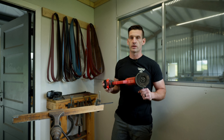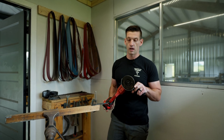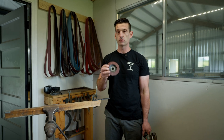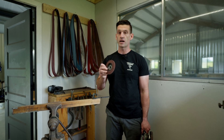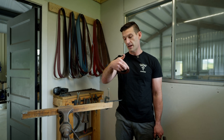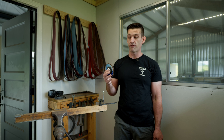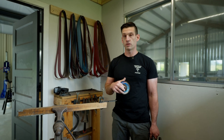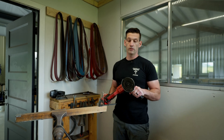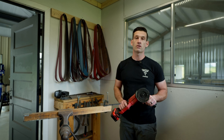There are different wheels you can get for angle grinders. I've got a hard wheel on here, and another option is a sanding wheel — this one has little strips of sandpaper on it. You can get these in different grits; this one is about 36 to 60 grit, and you can get finer grits to help get scratches out of your blade. For this purpose, we're going to be using a hard wheel and a battery-powered angle grinder. I'm going to put my safety gear on and we'll get started.